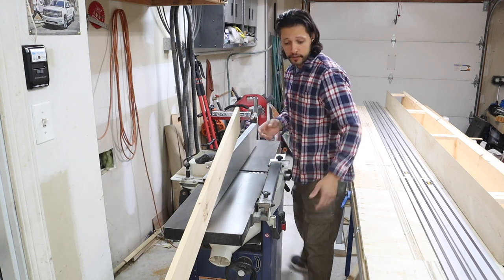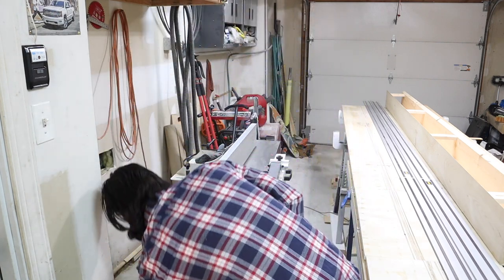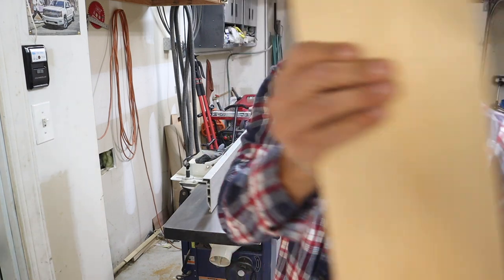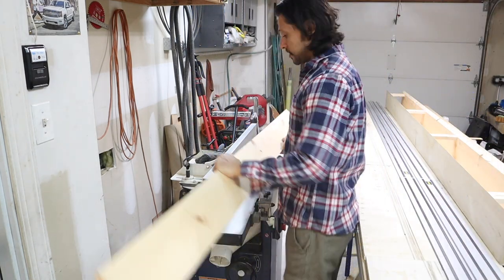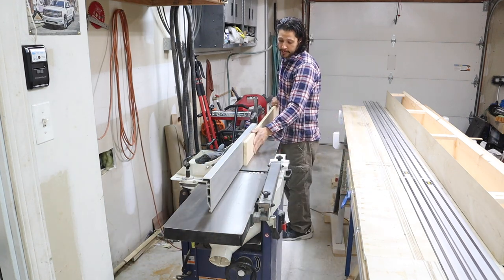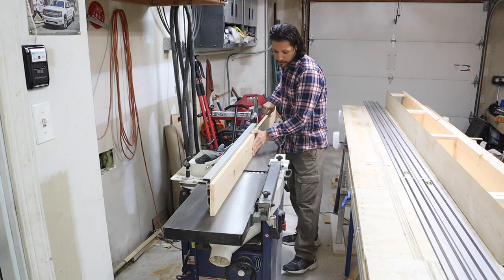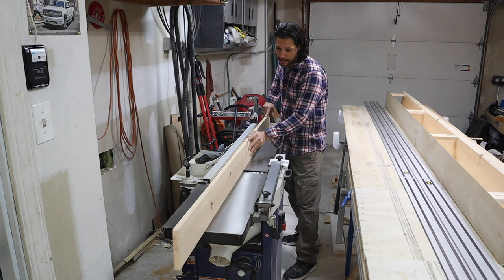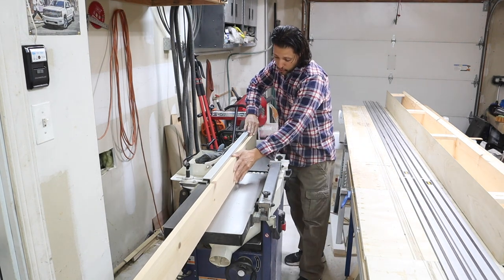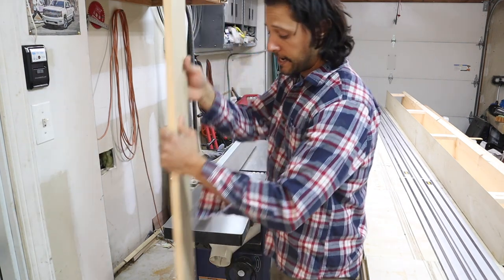If you have a board that's maybe six, eight, or even eight and a half feet, it's absolutely no problem on the jointer. Here's a five-and-a-half to six-foot board — start right here, pass it through, get it to the outfeed side, maintain your pressure, pass it through, and it's perfect with no problem. So let's get over to the track saw and I'll show you how effective and safer this can be.